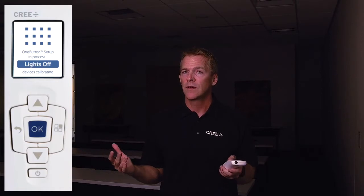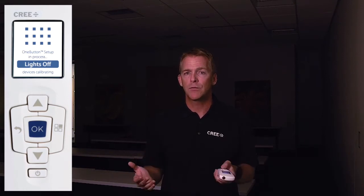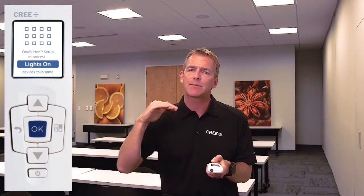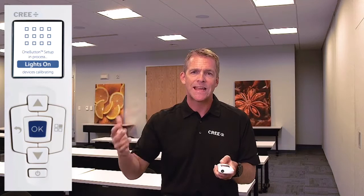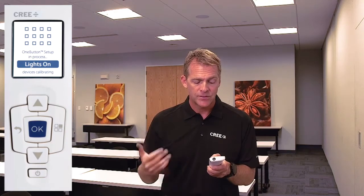The lights just turned off, indicating we're moving on to the next step: calibration for daylight. The lights turn off and they measure how much ambient light there is, so they know when they come to full power how much light they need. That's the set point, so the system can keep light levels correct when daylight comes in and ensures the light level stays optimal. Lights on — calibrating.